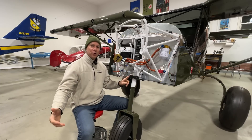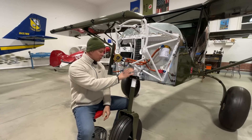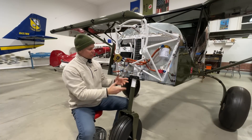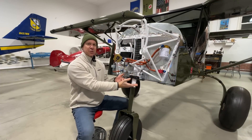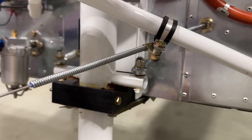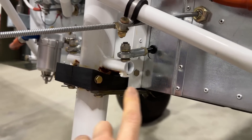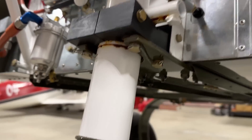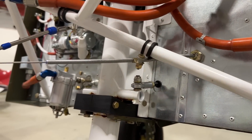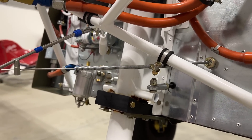A half inch of space is going to lower the nose, which puts the propeller closer to the ground — which I don't want in a bush plane. So I want to remove this gear and slide all of these collars up so it basically raises the fuselage to where it should be. In order to remove this I need to disconnect both of my steering linkages, remove these two bolts, and remove the safety wire. It's kind of a hassle but better to do now than later.